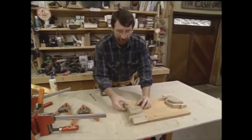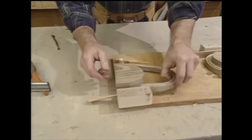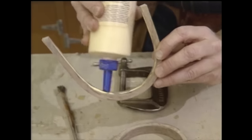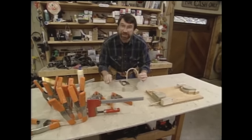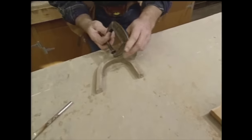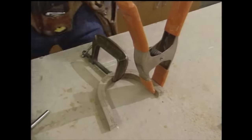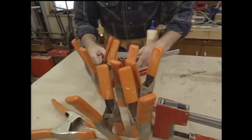Here's a form with a couple of the hooks that have cooked for a while — I did them earlier. You can see the wedges get loose when they're done, so they easily come out of the jig. The next step is to glue them together — just a matter of spreading some glue on both pieces where they're going to meet. Bending both pieces at once really makes this job easy. Mike had never tried bending two pieces at once, but he thought it might work, and it turned out it worked real well. At the bottom of the hook I'm just going to use a small C-clamp to snug it up, and a couple spring clamps at each end.